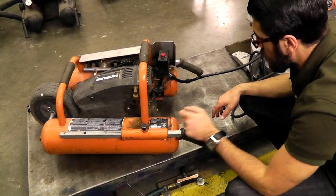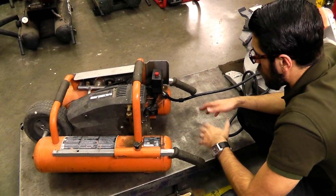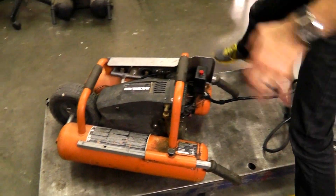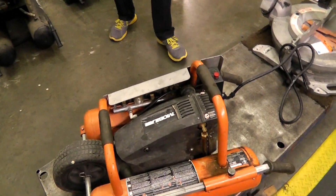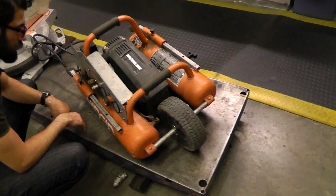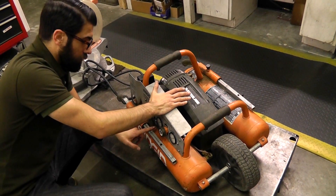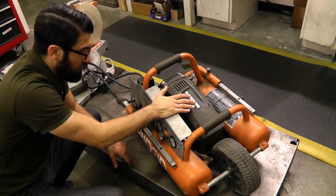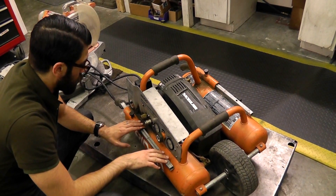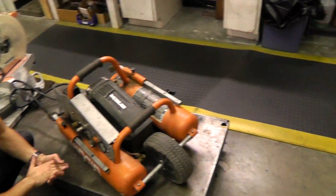Of course you have your drain cock in the bottom of the tank to release moisture — in a humid environment definitely drain it. I'd say drain it after every extended use or so. And that's pretty much the basics of the electric air compressor: your pressure switch, regulator, outlet gauges. Next time we'll do a video on maintenance of an air compressor so you know exactly what to check and when, to keep your compressor running at optimum efficiency without any hiccups. We'll see you next time at aircompressorpartsonline.com.